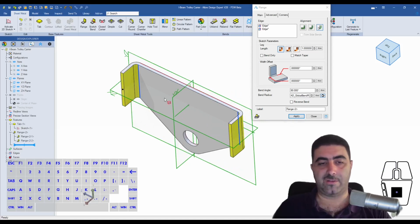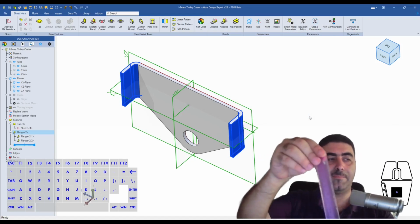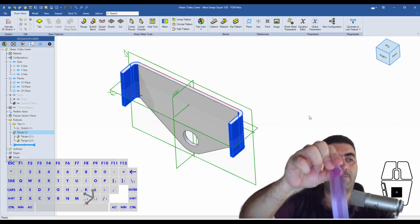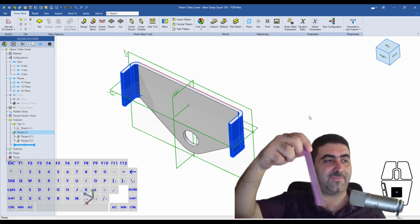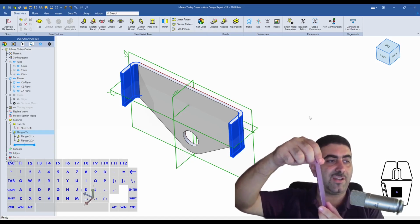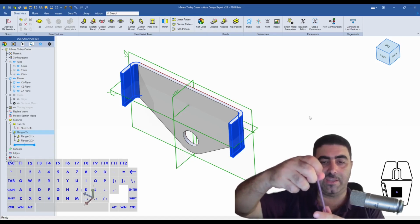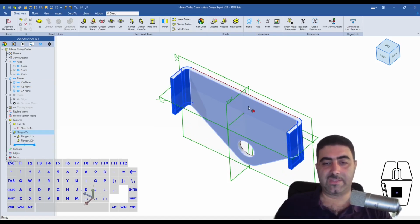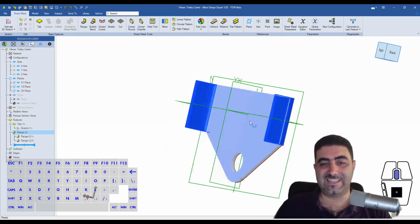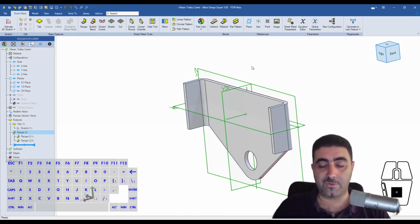Okay, now look, as soon as I add these flanges, something very, very different has happened. The middle part, of course, still has the same moment of inertia, but the flanges are now located like this, and their moment of inertia is hugely, hugely larger. So this can now take significantly larger loads in that direction than it could before.